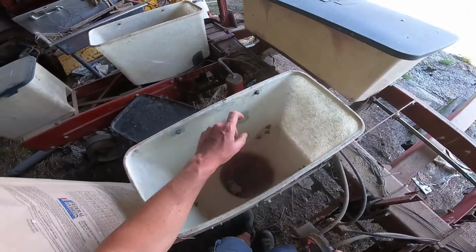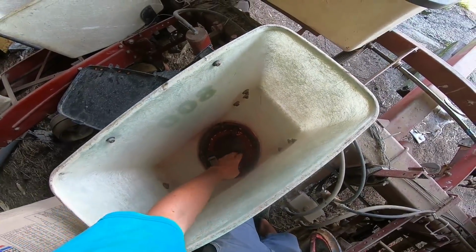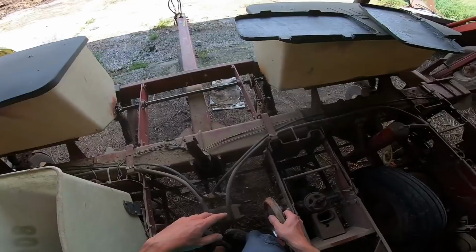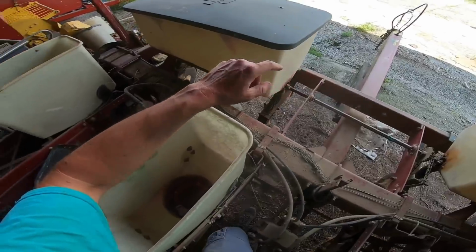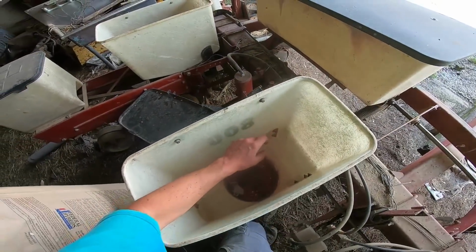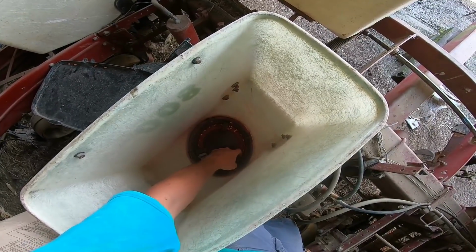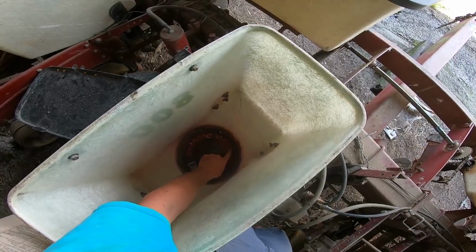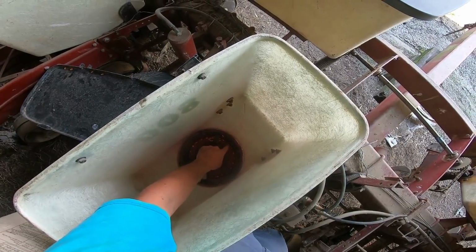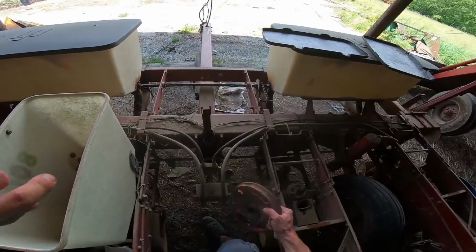And that's usually kind of the clicking noise you'll hear from these planter units. I mean, I know we hear like that grinding, screeching, because there's probably dirt or something in behind the fertilizer opener discs. But you'll hear kind of a clicking and popping, and that's those bars pushing seeds out of the plate hole, so there's a single instead of doubles or whatever. It helps with seed metering.